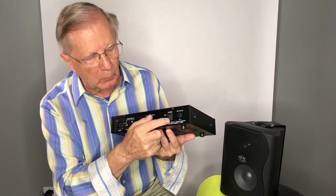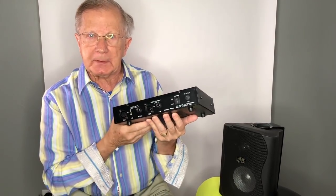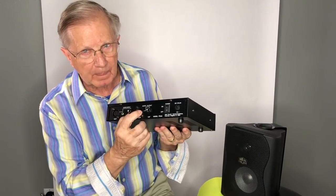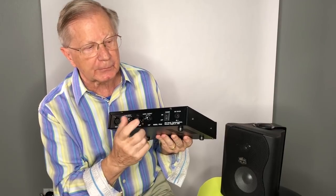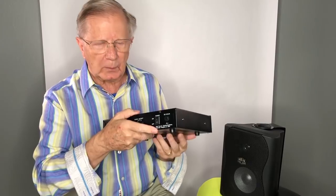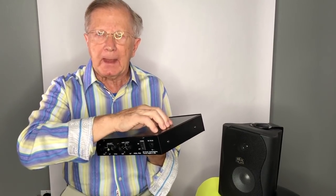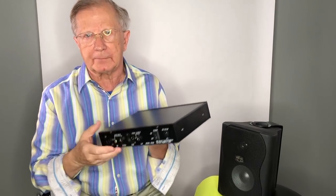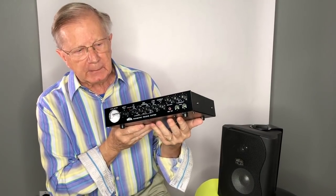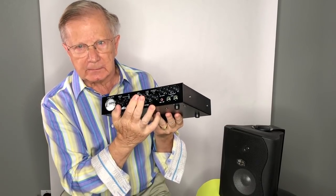The output of that will go through the XLR to the HP5 speaker — we'll go through that in a minute. This is a balanced line XLR, and we furnish you these cables. The power supply end is a transformer, and there's quite an extensive power supply conditioning, and then all of the plus-or-minus 15 volts to run all of the ICs. But the parametric mids are the key to this product.